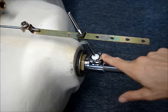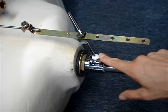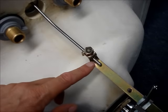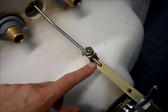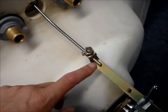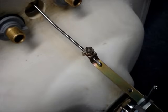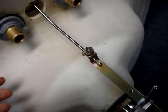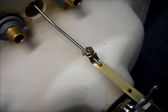To free up the stopper, we'll have to remove the pivot rod from the body of the drain. Mark the location where the faucet's lift rod is connected to the adjustable strap. If you don't do this, you'll have to do an extra step when you reassemble everything and adjust the mechanism so that the stopper moves up and down in the correct range.